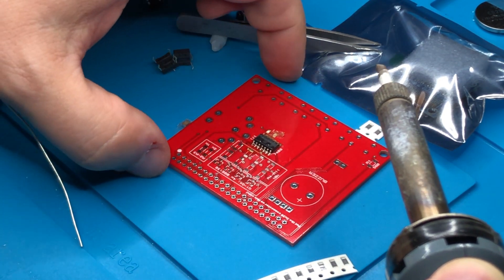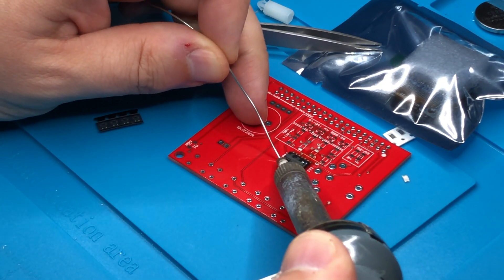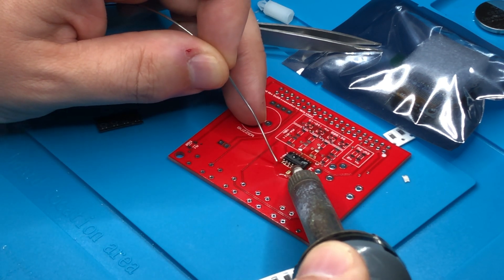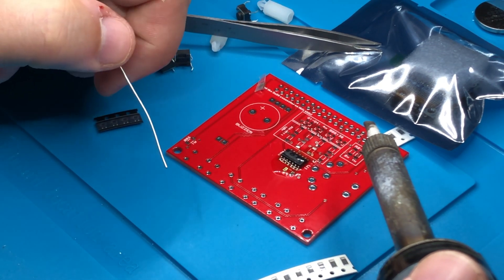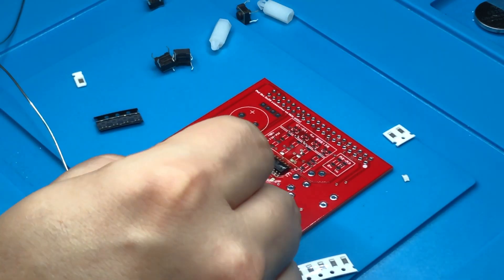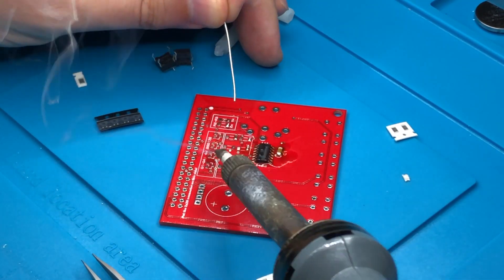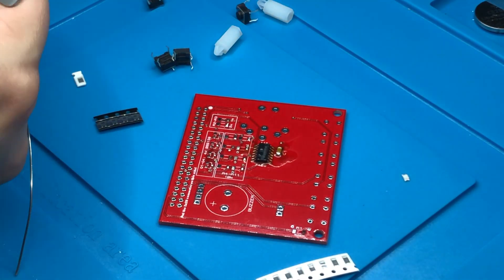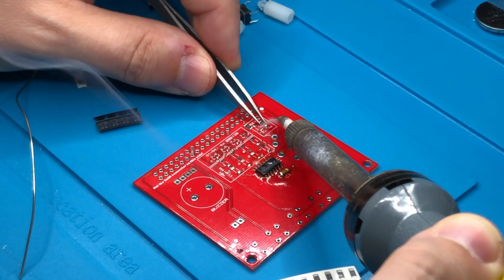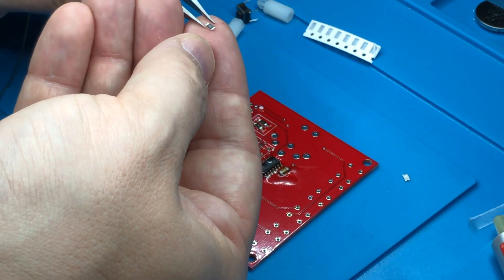I think this is the easiest way to solder surface mount components with just a normal soldering iron. On the other side, I put a lot of solder on the tip and bump each little leg, letting it suck up as much solder as it needs — it just adjusts itself. For small resistors and small MOSFETs I use a slightly different method: I put tin solder on the first pad, then add the component with tweezers and let it find its position, soldering one side first, then doing the other side or legs using the same IC method.